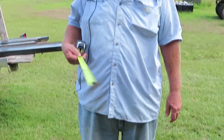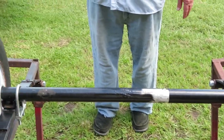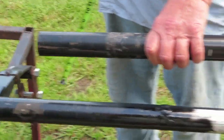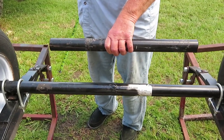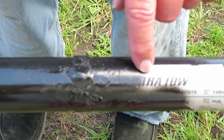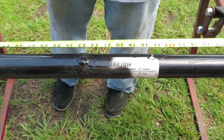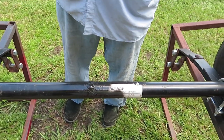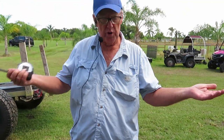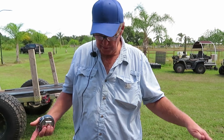My first obstacle - I bought an axle from Northern Tools. I'm going to use golf cart tires on it, which is the cheapest option. If you're going to actually build a trailer and put it on the road, you just got to buy new tires, rims, and the axle. What I had to do was make it narrower. I cut a big chunk of the axle out, re-welded it, and inserted another piece of steel inside the tubing. The axle from hub to hub is only 44 inches, so the outside tire to outside is around 54 inches.